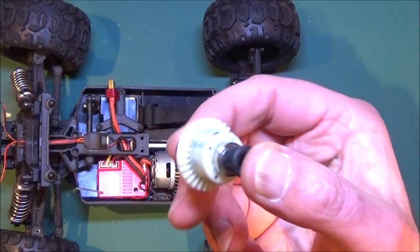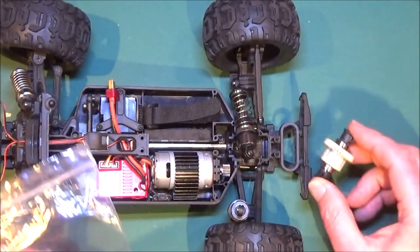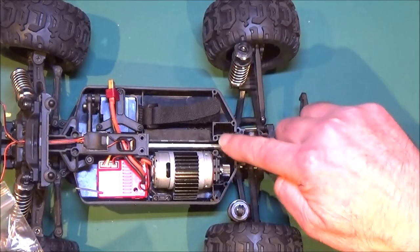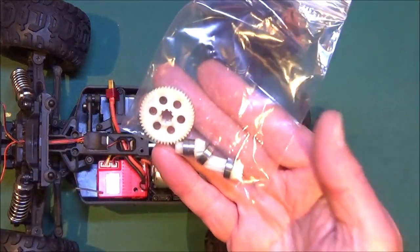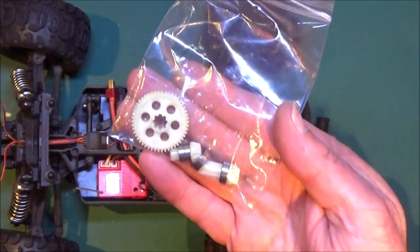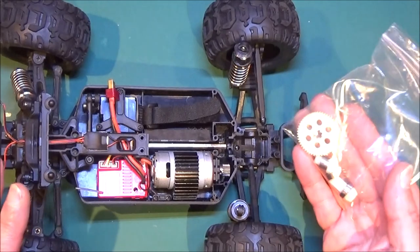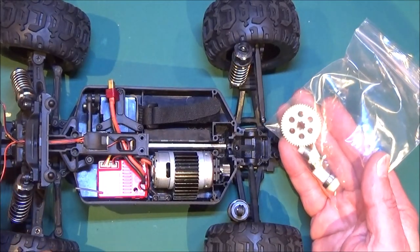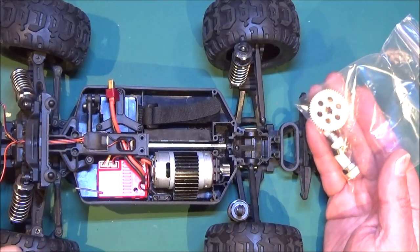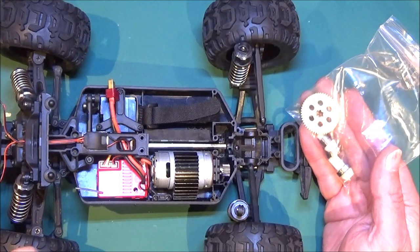So this is a funny little unit. If we just pull off the one bearing at the back, then you should be able to pull that whole gear out from the spur gear. So this is the spur gear, and then we need to get this bearing off the bevel gear and get a new one of these. So that's all cleaned up now — I used a bit of white spirits and a brush, cleaned it up, dried it off, and cleaned all the inside of the case out. Got rid of all those bits of plastic. And here are the new spares that I've ordered. I actually got these from the UK — I spent a long time looking for spares for this 16889, and the only spares I could find were in Hong Kong or China, all quoting 40 days delivery.